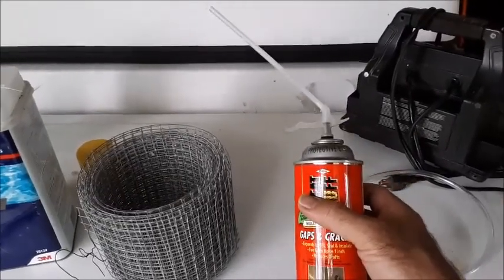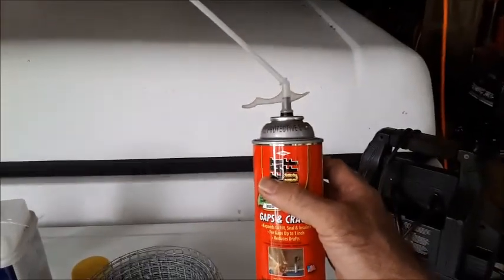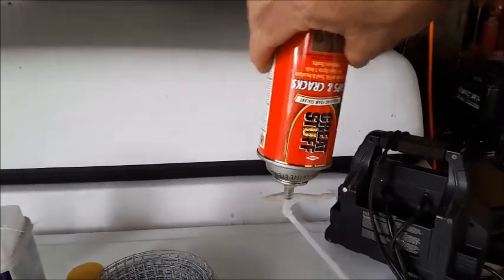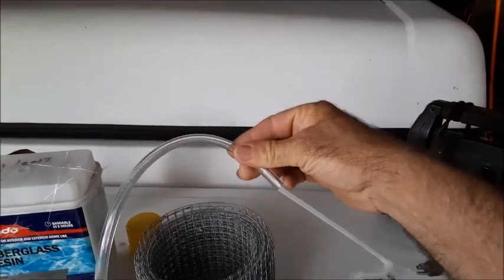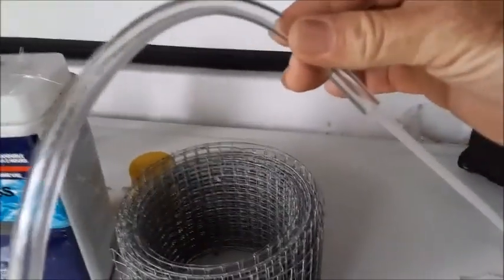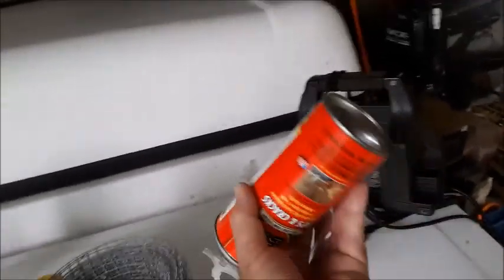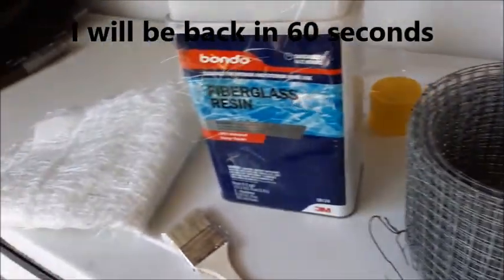Sometimes spraying underneath with a spray foam can is a little difficult because when the can is upright it only blows out air, so the can has to be inverted upside down to have the spray foam come out. What I do is take a clear piece of plastic tubing and insert it right over the end of the spray nozzle. That way you can shove the end of your tube up into hard-to-reach areas while still keeping your can inverted upside down. Let's get started on our repair and I'll show you how to use these products.